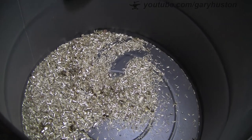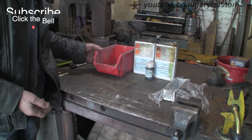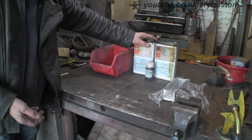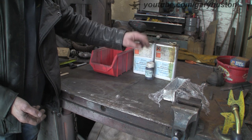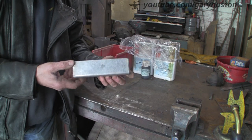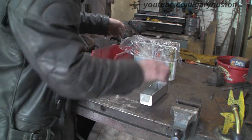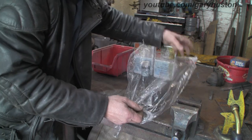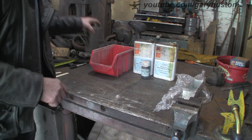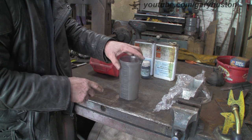All we've got to do now is find something to put the whole thing in. Okay, so this is some considerable weeks later. I've got a mixing jug, my brass kept clean in this tub, and my very old epoxy — a good 10 or 12 years old — and the black dye. I've made myself a little tray out of a bit of Zintec, just folded up with a couple of ends welded in, lined with plastic parcel wrap. I've worked out I need 300 millilitres of epoxy to fill that tray.